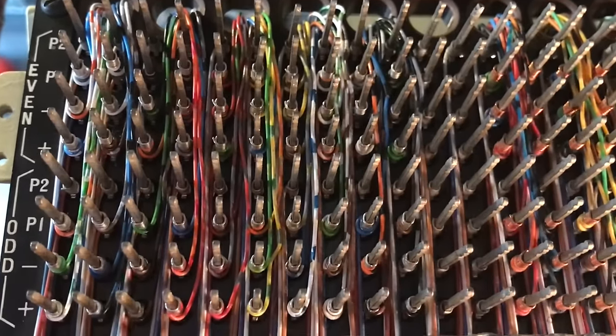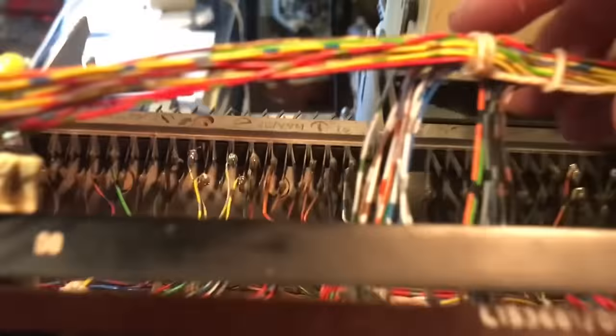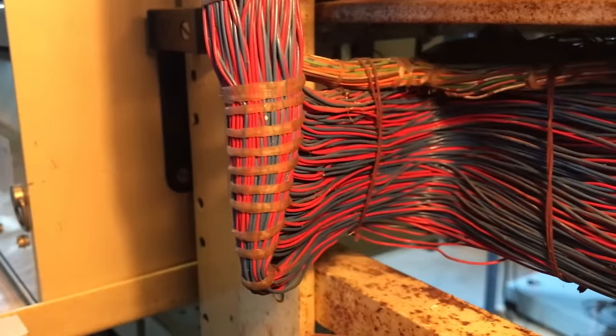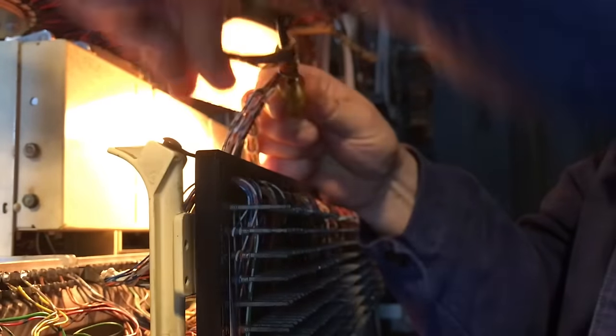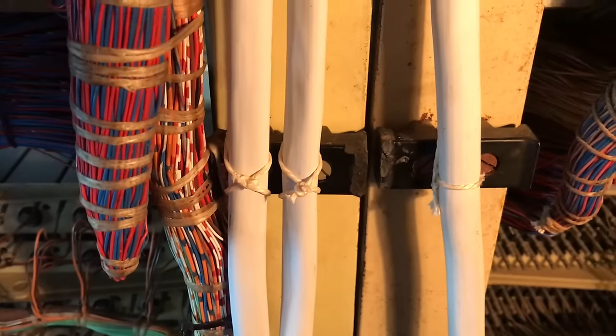We've brought out two levels worth here and I'm just tidying up around the back. Break out the cables like that and tie them up nicely with some waxed twine — that's called carotting, because as the cables branch off the main bit tapers down like a carrot. There are extra wires that we're not using at this stage — we'll probably use them later. So I'm just going to wrap them around the end of my screwdriver to get them nice and tidy and tuck them down behind the shelf.